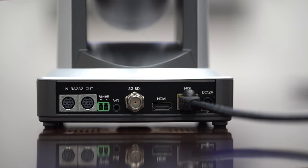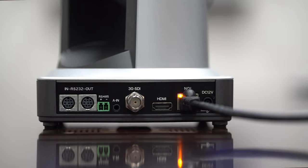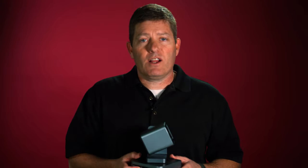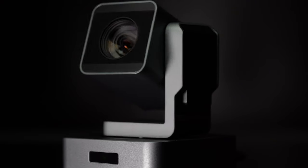That's very convenient, especially when you're installing cameras and the contractor is a low-voltage contractor without the ability to run an electrical outlet. You don't need one. If you're not connecting to a PoE network switch, you can use a PoE injector, which essentially is a power adapter — connect a Cat5 or Cat6 cable, run it to your camera, and it's powered up. These cameras use about 13.5 watts of power, so a very low wattage draw.